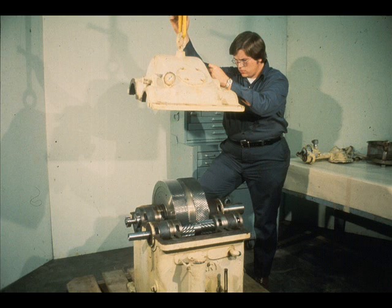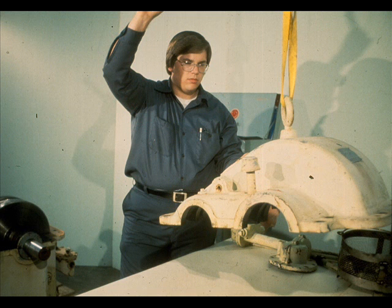Once the cover is detached from the gear case, lift it straight up until it is well clear of the gear case and gears. Take care that the cover does not bump the gear teeth in the process. Then set the cover aside on a surface that will not damage the machined flange of the cover. Wooden runners placed on the floor are ideal for large units.